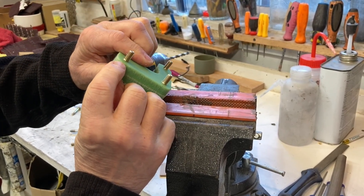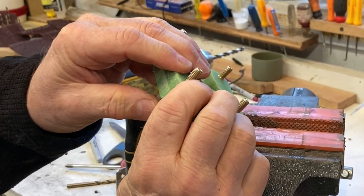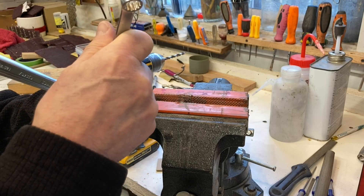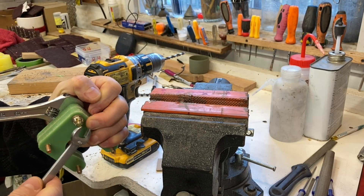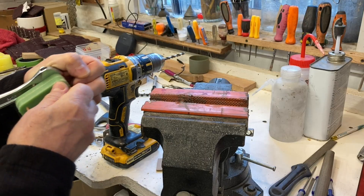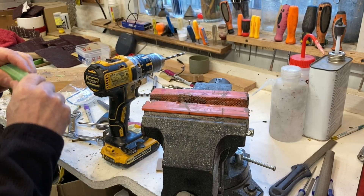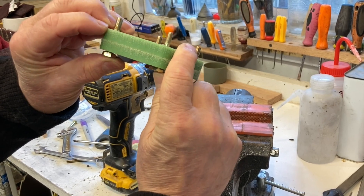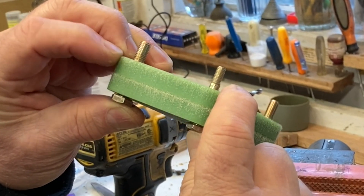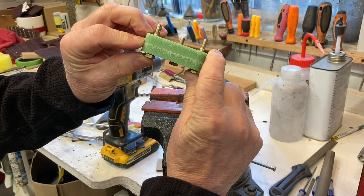A little sticks out of there and I've got two layers of very thick aluminum to go through, so it might squeeze down a bit. As a matter of fact I'll try it — that's about 20. You can feel it's different. Let's take that off and see if it slipped up in there very far. I don't know why the specs are so different — I got these from Aircraft Spruce. Slide this in so you can see the difference. These little details I think really matter. So that would definitely go through — you'd need a washer and it'd be great. This one goes all the way up, snaps right up tight. Just not enough there. That's what we're gonna do.